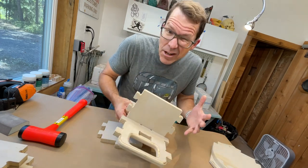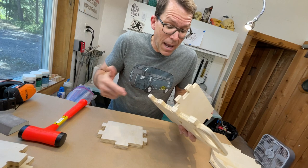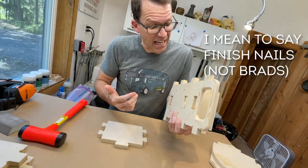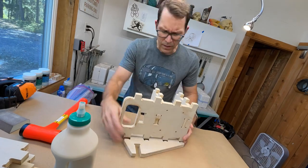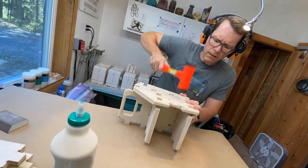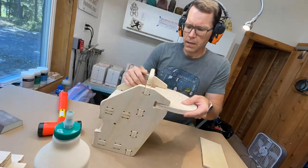I'm going to see how snug the parts are — I might put a dab of wood glue in there, and then once I've got everything assembled with wood glue, I might shoot a couple of brad nails in there just to really lock it all together. These parts fit together extremely tightly, tighter than I expected. I'm using this as a dead blow hammer — a non-marring hammer that I can knock the wood together without actually damaging the wood surface — and as you can see, it took a lot of pounding.